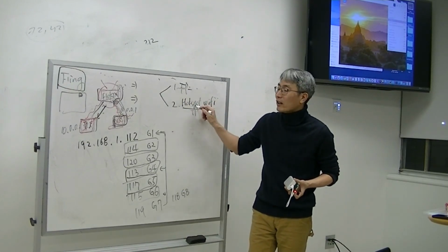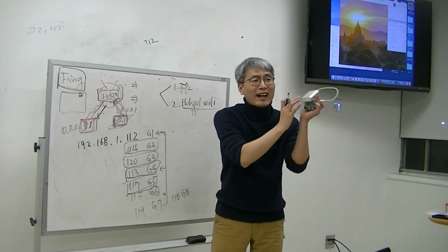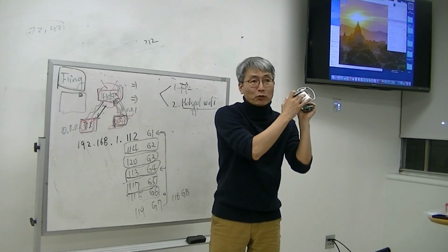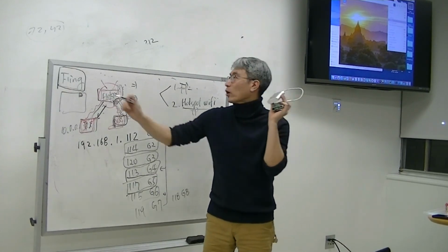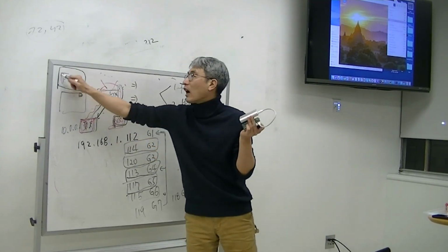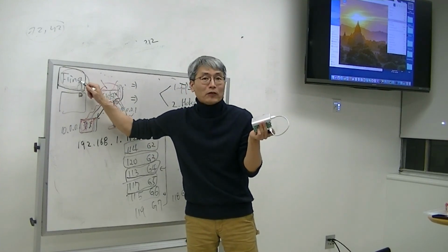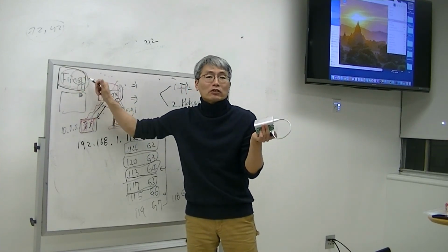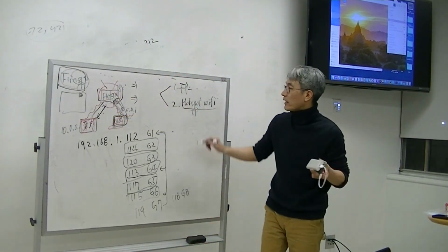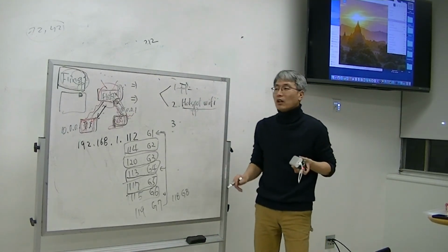Okay, how do I check? You can use some cell phone hotspots that provide the connected devices with IP addresses. So you can check the IP address and use that new IP address to connect. Otherwise, download and install an app. This is safe, so you can use the scanning tool to find the Raspberry Pi's IP address, then connect. Then, third thing, this is the homework.